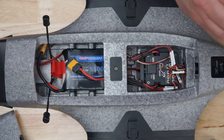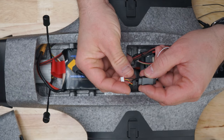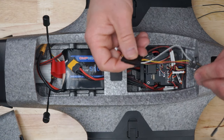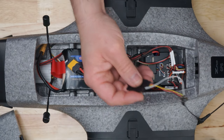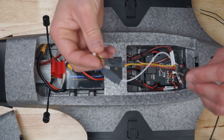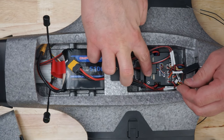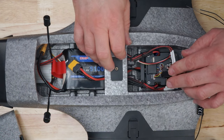This will remove the other hatch that's over the flight controller. You're going to need a connector to go into the flight controller. For this video, we're going to use some other connections here because I want to be able to swap out the receivers and show you how both receivers connect to the flight controller. Normally, you would just have your receiver directly to this connector. This connector goes into the flight controller right here — it's a 4-pin.